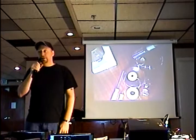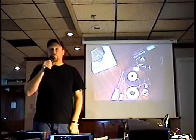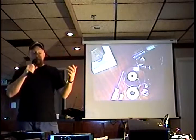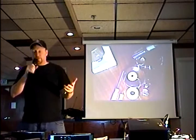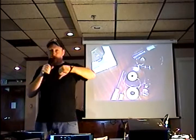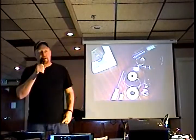And that involves doing a hard drive swap. What it is basically, you need to hook up the power to the hard drive in the Xbox and plug your computer into it. Boot Linux, right as the boot process comes up, you need to swap the cables and plug your Xbox cable back in. A lot of people, it takes several tries to get it done. It can be time-consuming.